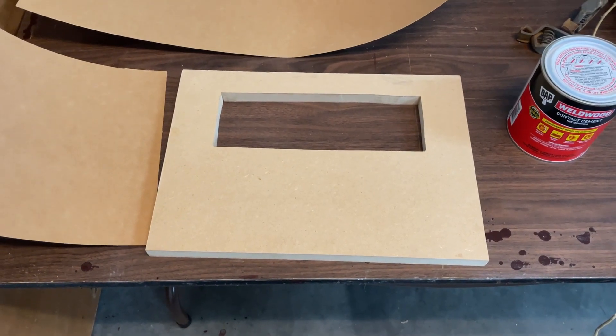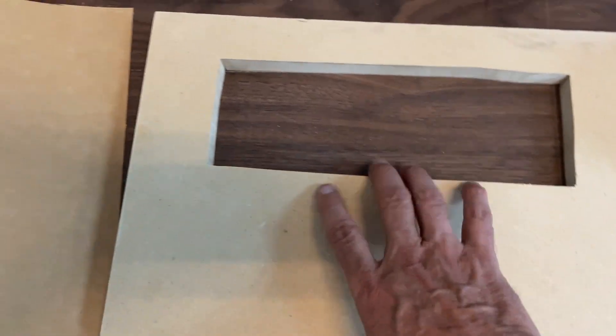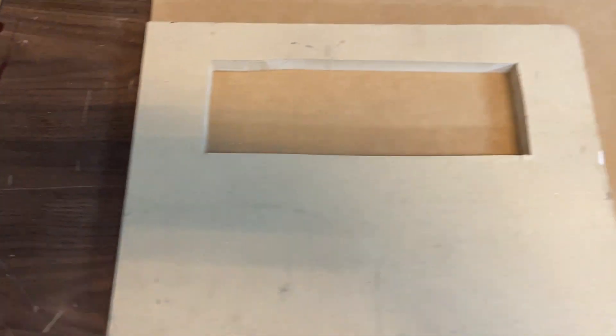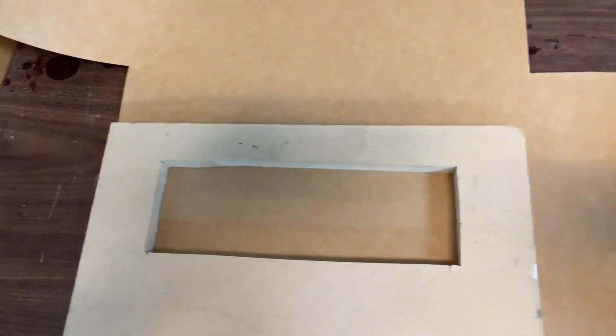The way you would start, as I mentioned in part one, is you do the outline. If this is going to be the top, you line it up on your large piece of veneer. What I do is try to get a good edge — sorry, this is hard to do with one hand and not break my veneer. You want to try and get one edge lined up, and it's okay if you overlap just very slightly because you can always cut or sand that off. That allows you to cut just two sides and not have to cut four.